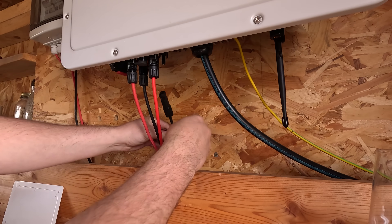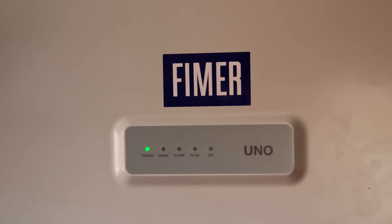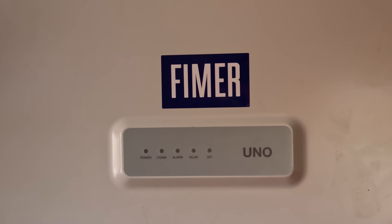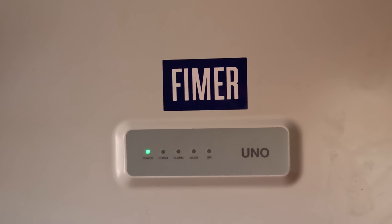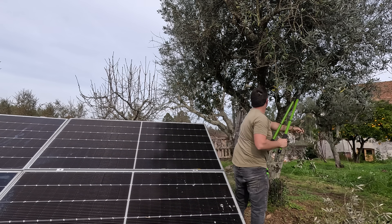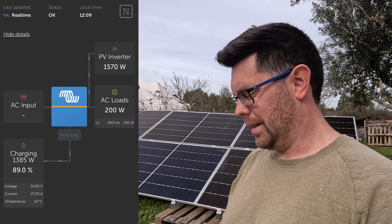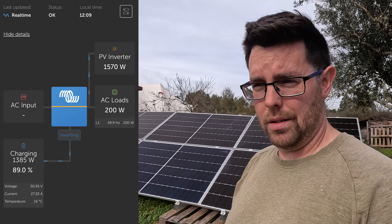Positive to positive. Negative to negative. That's promising. Also promising. So the good news is everything is working properly — we've got more power coming in. It has just gone 12 o'clock and we've got 1,500 watts coming in, which is more than the 900-odd that we had before. It's not a particularly sunny day today so it's not a super impressive difference, but we have got more power coming in, which is the most important thing.